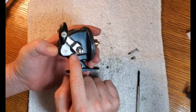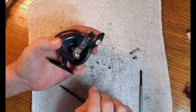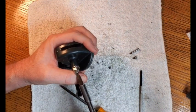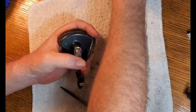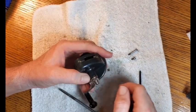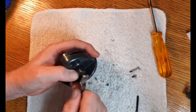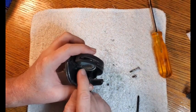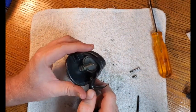There's only one side plate and no screws on the other side. To get the main gear out, we need to remove the nut and handle. You can do that with a screwdriver, a coin — a quarter fits — or a ratchet or wrench. We pull that handle off and that will allow us, once we get the pinion gear shaft out, to push out the main gear.